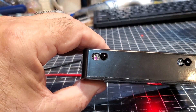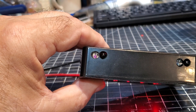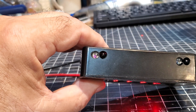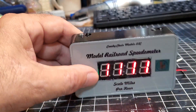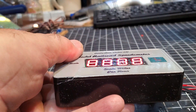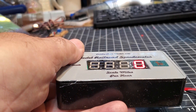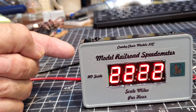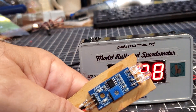I initially put the sensors on the top. You can see the purplish color there — that's actually a little trick you can use to determine whether your sensors are transmitting or not. Your cell phone camera will show you that glow so you can tell the sensor is transmitting. This one has to lay down next to the track. The sensor has about two inches of range, which isn't a big deal, but looking across the layout this one's a little iffy. So I thought it would be great to put the sensors out the back, but I ran into a little problem with that.